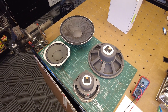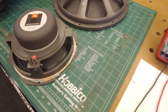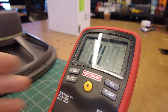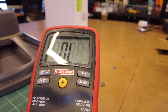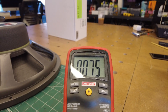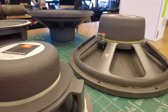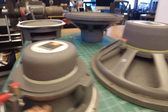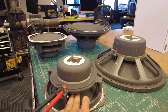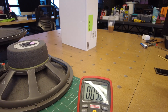Here's the set of four. I'm getting ready to do final testing and installation. A quick check — we're going to go ahead and just check the resistance on these. Connecting up to the upper bass drivers, it's going to yield somewhere around seven or eight ohms. I think we're reading about 7.5. Now the impedance rating is 8 ohms — don't expect to see the exact value on the meter because the position of the cone will affect the impedance reading. We'll do a better test on our bench equipment in a bit.